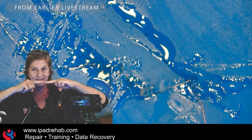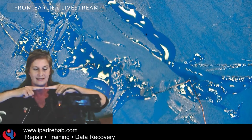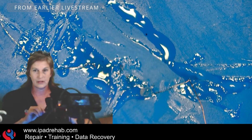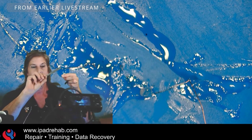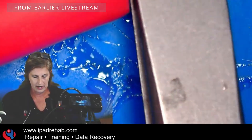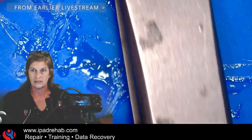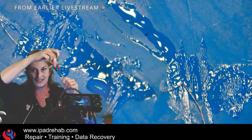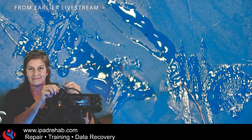So if you run battery voltage through a short that's very, very tiny and has very high resistance — it's a thin little wire — you can actually burn the short. Now that doesn't work with a big short, like a big fat wire. If I do the exact same thing with a big wire, you can hear my DC power, and look — I can hold it, it's not getting hot at all. It doesn't burn. Why? Because this is a big short with low resistance. It's a big highway — it's not going to get hotter and burn.